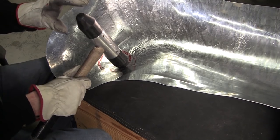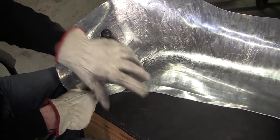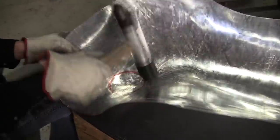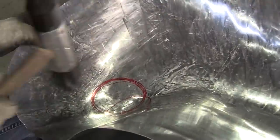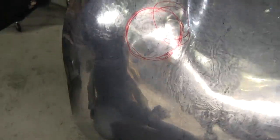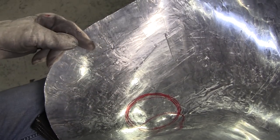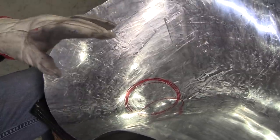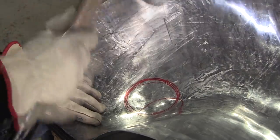But this is now the new problem, and that's what happens, is the problem will shift from one spot to another spot to another spot until eventually it touches everywhere. I'm going to blast that out a little bit. Remember, most of this panel, I would say probably the panel is formed by about 80% to 20%. 80% shrink, 20% stretch, very little stretching.